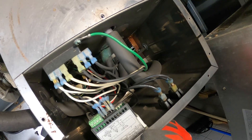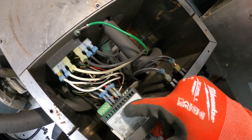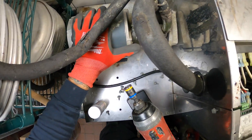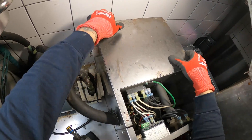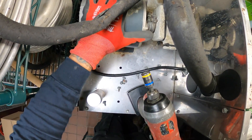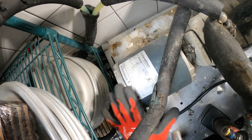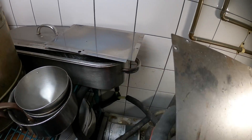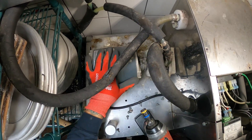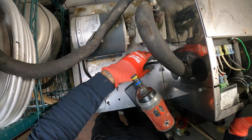I found the temperature controller and it looks like there's a little expansion valve in there. The red is the sensor. I hear this motor trying to start — I heard it hum and then it shut off. It's probably a thermal overload in here. It's got to be this motor. My first time on one of these — can't be too hard. It hummed and it ain't doing nothing, so let's follow this wire.